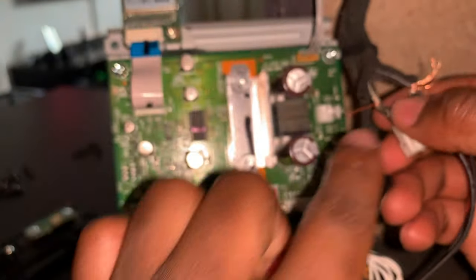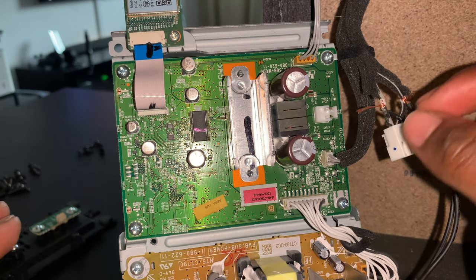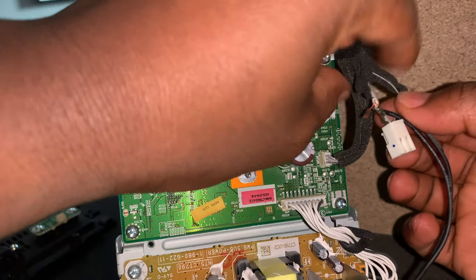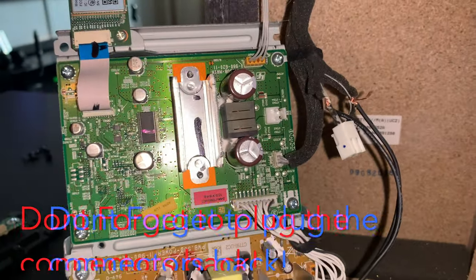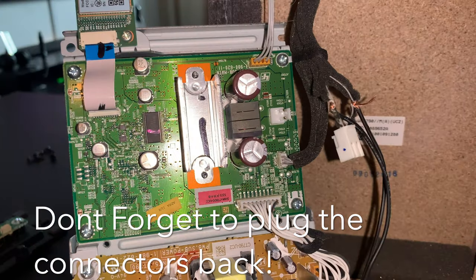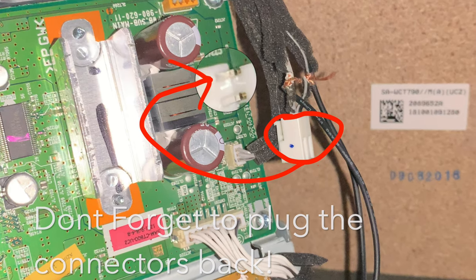Make sure you wrap the wire correctly so the two wires don't touch each other. If they do touch, the subwoofer's protection circuit will keep shutting it off and you won't understand why. So when you connect these two, wrap them with electrical tape or duct tape so they never touch. I'm leaving mine unprotected only because this is a demonstration and I won't be keeping this small speaker. I'll go ahead and plug this back in and we'll test it out with some music.